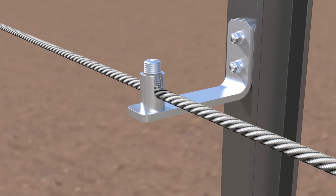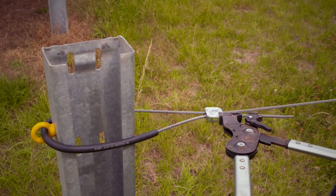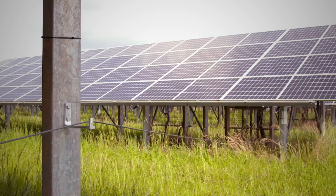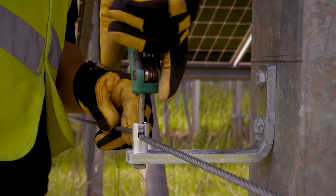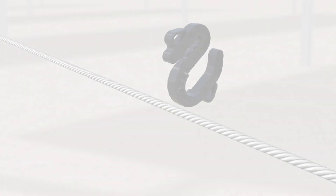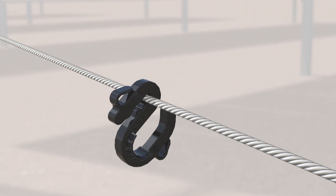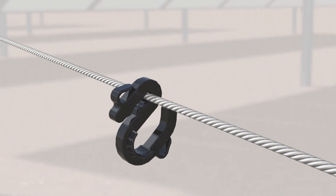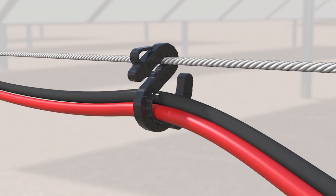Let's take a closer look at the new components of BLA+. The messenger wire system quickly and easily installs on the tracker piles using a unique tensioning system. This creates a stable line which can mechanically support the BLA. Custom hangers designed specifically to carry the BLA cables easily clip onto the messenger wire system, and the BLA trunk bus cable readily fits into the clips.